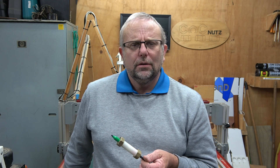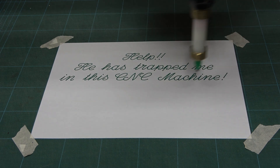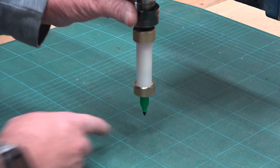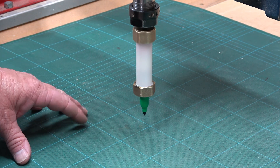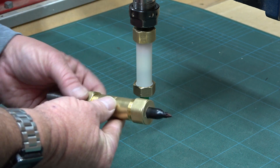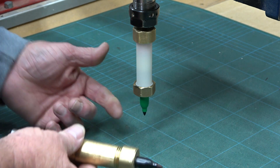And there we have one spring-loaded pen ready for the CNC machine. So I put this here in the spindle and the pen's got nice movement there up and down, and as you saw it works really well. When I rotate it, it's got a small amount of wiggle in the tip of the pen there but not a lot. But can I do better? Which is why I went and built this — it's the Rolls-Royce version. Basically internally it's very similar to this one here, however this was made on a lathe. Unless you've got a lathe you will not be able to make this.